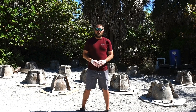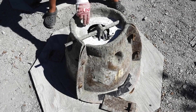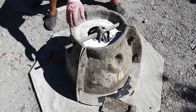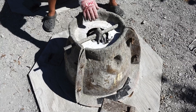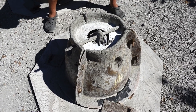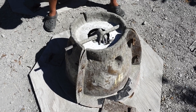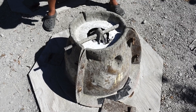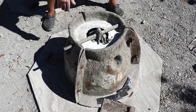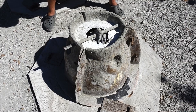Here at Tampa Baywatch we actually use them to create living shorelines and to help with shoreline stabilization. Here we have one of our oyster reef balls created by community volunteers. You can see that the oyster reef ball is inside our mold with our mooring buoy or bladder in the center to make sure that there are spaces and gaps for fish to travel through, also for oysters to attach to all the surface area created by these. We will take these apart with community volunteers, then put our fiberglass mold back together, and then finally pour the marine friendly concrete in order to create our next wave of oyster reef balls.